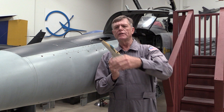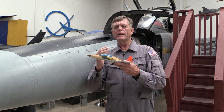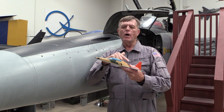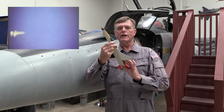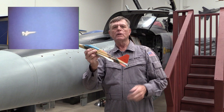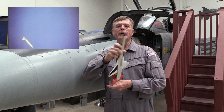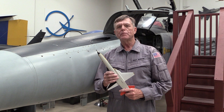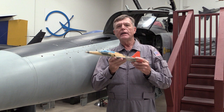And in the case where you're flying at a forward or a mid CG, really it's not a problem. Forward stick recovers the airplane and you really don't have an issue. But if you get more to the aft CG, where the moment arm from these forces has more effect on the airplane, the pitch up can actually be to such an extent that you get to a point where the fuselage blanks the tail, and now there's nothing to stop the vortex from causing a rotating motion and the airplane can enter a spin. So we went from a T-38, which really doesn't have a spin mode, to an F-5A, which is hard to spin but can be done, to an F-5E, to eventually the F-5F. Now this is where our problem came up with these changes in nose shape.